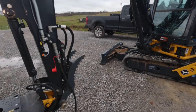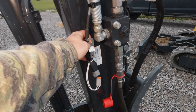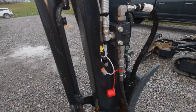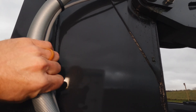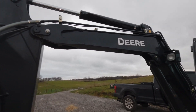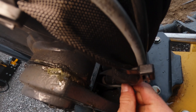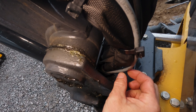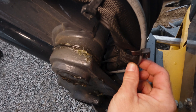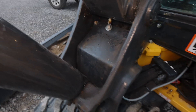Before I put all the guards back on, I wanted to show you what I did with the cable routing. I started here — I'm going to drill and tap into the boom and have this connector mounted there. Then I routed it up and over, making sure to leave slack, and I'll clean that up with more zip ties when it's not so nasty outside. Coming down back over the boom — this is really the critical part. There is a rubber strain relief right there where this metal piece squeezes together and all these hydraulic hoses go through. The wire fits there too, which is a good thing — that's where the boom lights go as well, and it's a nice secure spot. It's not being pinched because I can still move it back and forth. This guard is all tightened down and everything's good to go.